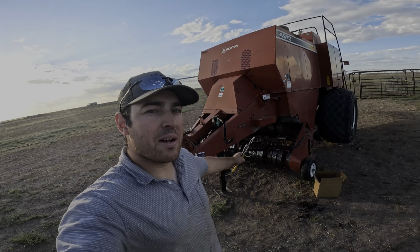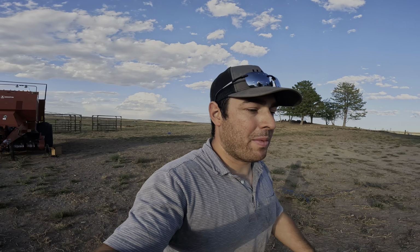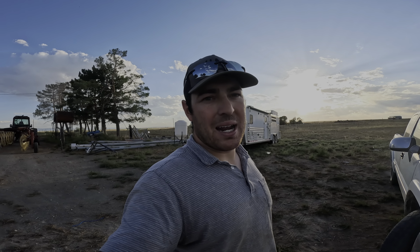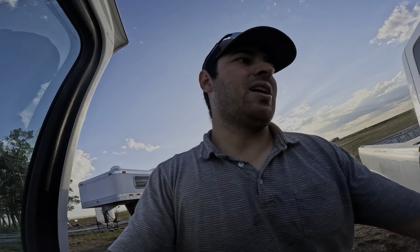All right, we're in a much better spot now with the baler. I have a lot more pickup tines on it. It is not perfect. I'm going to blow it all the way apart and fix a whole bunch of stuff after this cutting of hay. Put some wrapper bands back on. On the end of the bars, there's a special wrench you need to get the pickup tines replaced. We got to do that. But all in all, I think I bought 25 tines and I probably put 18 on there, replacing singles and completely broke ones. Because there's 2 tines, they each have a tine on them, so it's like a double tine.